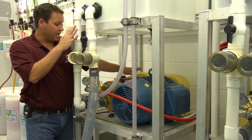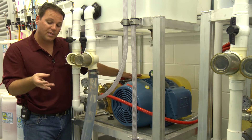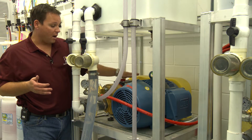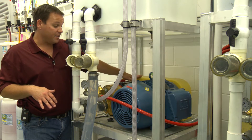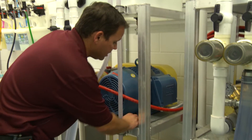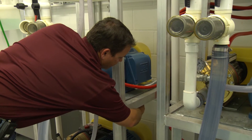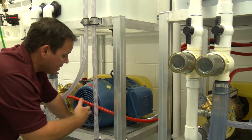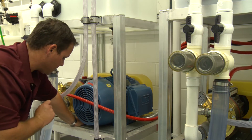On a monthly basis, we're going to check the tension on our belts. When we check the tension, we're going to remove the belt cover and inspect the belts, looking for any signs of premature wear, cracking, or stretching. If we need to replace our belts, we always replace them as a set — in this case, the set is three belts. To remove the belts, you simply loosen up these four three-quarter bolts that hold the pump tight. There's a tensioning bolt directly under the frame. As you turn the bolt one way or the other, it'll push the entire motor forward or backwards to either take the belts off or provide tension to the belts.